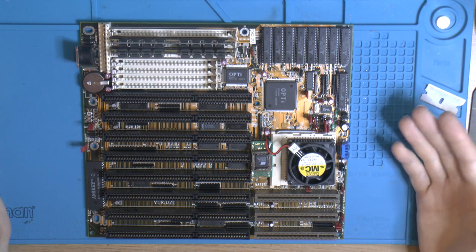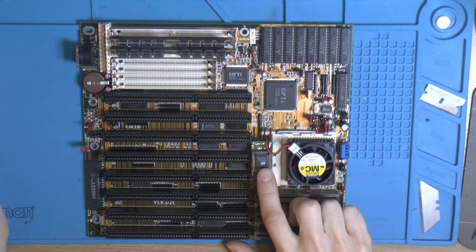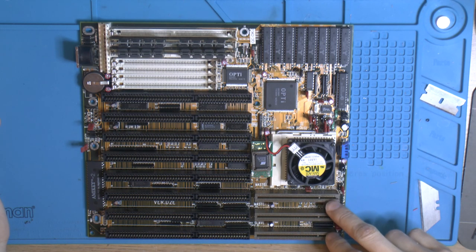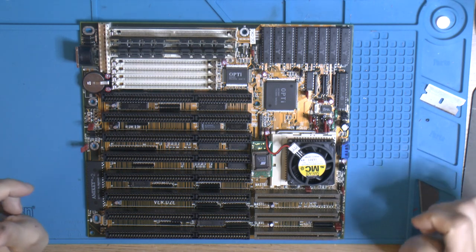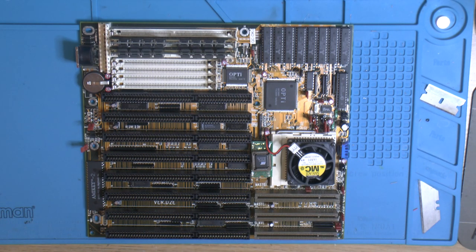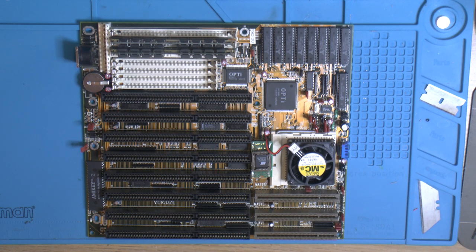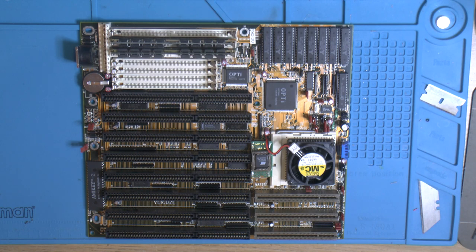There's software to solve this with Cyrix, but in the end I made an adapter and burnt a new ROM from a board that has the same Opti chipset, exactly the same, and that board also had VLB bus support and everything. So I burnt that, tried that, and it works like a charm. I can run the 40 bus. Before I couldn't, it would POST but not boot anything like DOS, so it would just hang. Now it's stable, it's detected as the proper CPU, and the performance is there. There's no software needed, it just works really well.